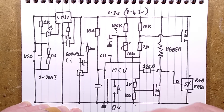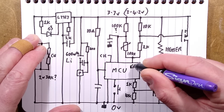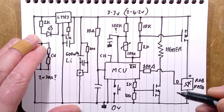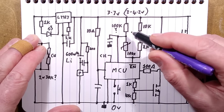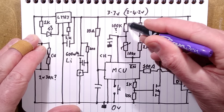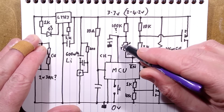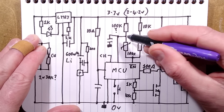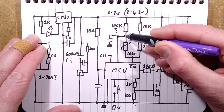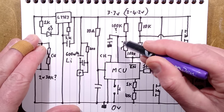It's got a button input that just pulls to the 0 volt rail. Then it's got an interesting output — this is the enable, active low. When the unit is turned on, it turns on two things. By pulling this low, it enables the thermistor network, which is based on a 100k resistor and a definitely 100k thermistor. They do match the value of the thermistor so that as the temperature varies, it acts like a potential divider and will vary up and down between near the supply rail and 0 volts depending on temperature.